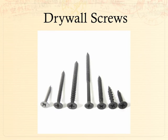The first thread type to talk about is a coarse thread screw. Coarse thread means it's got a larger, deeper thread cut to it, so it will bite or grab the material better. Fine thread screws means the threads are closer together and not as deep. They don't hold as well, but they do work and can be used in a pinch. Some of the really short lengths of screw are only available in fine thread. Common sizes range from three-quarter inch all the way to three-inch, and those are the ones commonly used in theater.